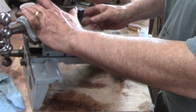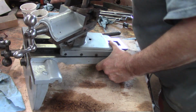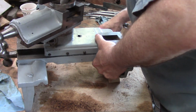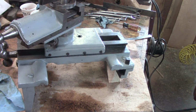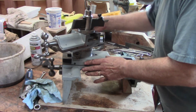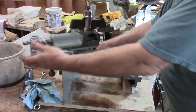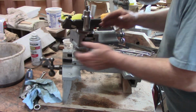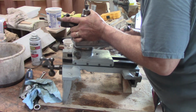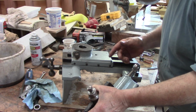And this not only serves as a cutter. You know, I'm not even sure that you can see this. Let me get this propped up. There you go. If you hadn't caught it already, this is the business that slides in and out. When I turn this crank, this goes in and out. It moves this business. This is adjustable, and it also slides back and forth on a set of dovetailed ways that moves this back and forth so you can get out over things with it. With the cutter, and without the cutter in it, it serves as a tool rest holder for freehand turning.